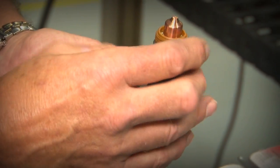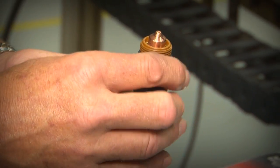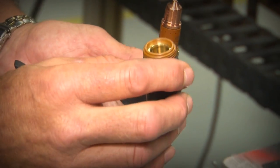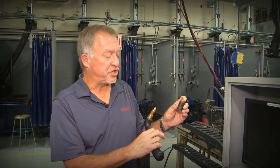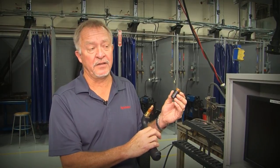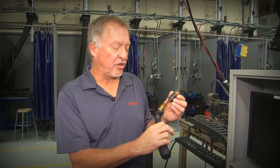The next part is called the retaining cap. Its function is to direct the air down into the front end of the torch and to hold the consumable parts in place. It has composite high-temperature threads on the front end that the shield screws onto. This part under normal conditions will last a long time — I've got a plasma cutter on a CNC machine in my home shop where the shield is the original one from six years ago. However, with a hand torch you can use gouging consumables or flush cut consumables, and during gouging you can get molten metal spray back that can damage the retaining cap over time. So they do have to be replaced occasionally, but not what I would consider a day-to-day consumable.